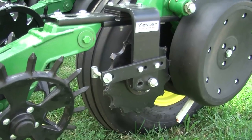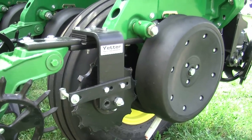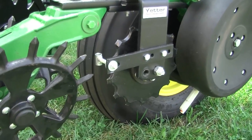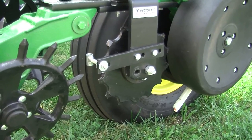The uniqueness of this is the fact that it's going right on the row unit. We're simply just setting back the closing wheels a little bit and allowing you to put your starter fertilizer two inches off the side of the seed. What's unique about this is we don't have to struggle to get our fertilizer off the seed.